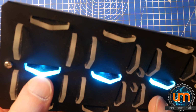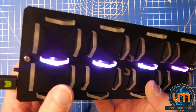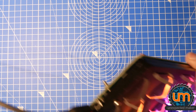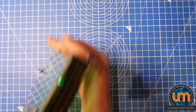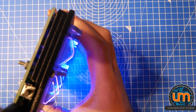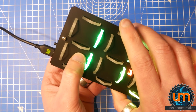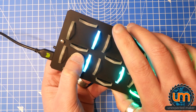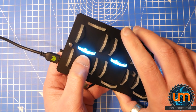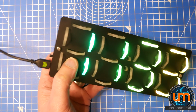What does that look like it's doing? Does that look like it's resetting? Let's see if I can get the cable over far enough. I've been squeezing the little reset button inside here that I thought was short enough to not get in the way, but it's not. When I tighten this too far together, it's holding the reset button down. Let go, it's resetting. When I tighten it together and plug the power in, it's holding the reset button down. It won't boot with the reset button down.